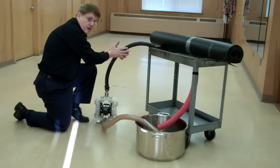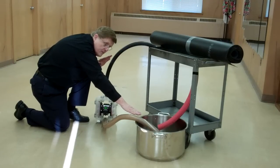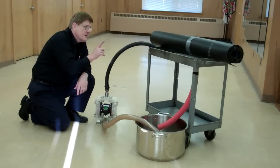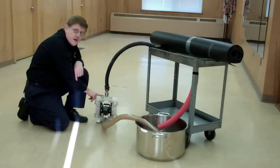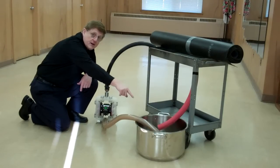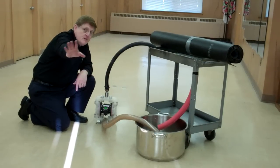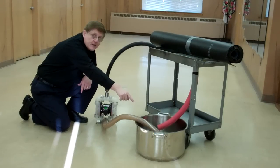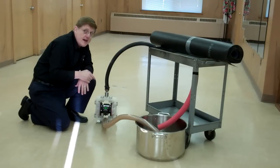In-line technology is more expensive than tank-mount technology, no matter who you buy it from. But whether you use in-line or in-tank, if you've gone to double diaphragm pumps or peristaltic pumps, you need a mixer in that bucket or no viscosity control is going to work for you. If someone tells you that you can control viscosity with no mixing in that bucket, you're being told a story that isn't totally accurate.